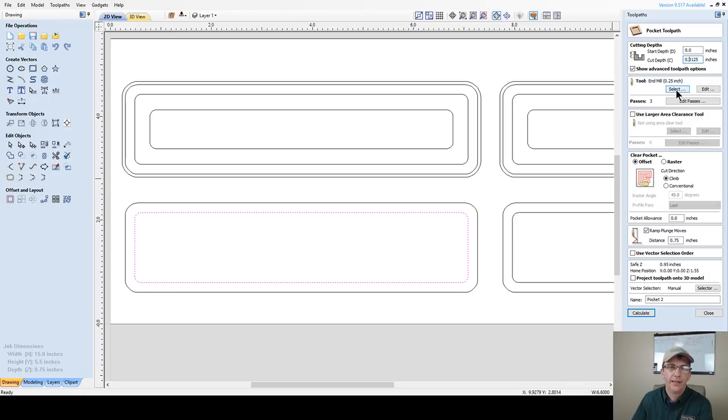All right, and still using that 1/4-inch end mill. Same bit, one bit is gonna do this whole box. Other than if we're gonna do any engraving, V carving and stuff like that, then you would have a second bit. But as far as cutouts and pockets and all that, one bit. So it's a one bit, one board pony.